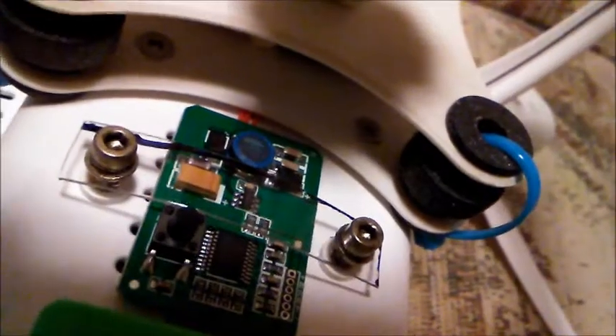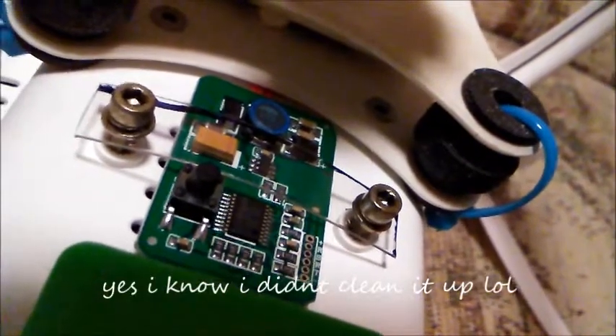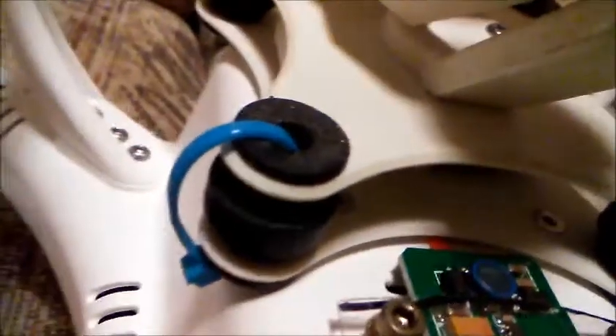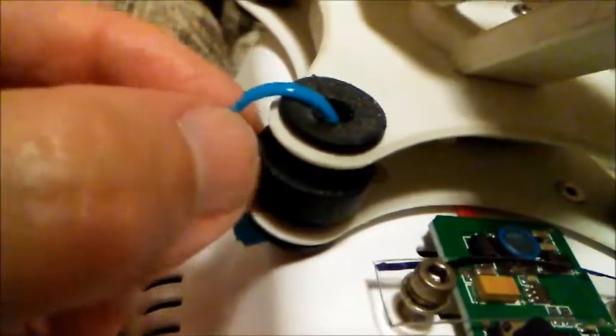You can see it right there. It's got those nuts that are built in — plastic and whatnot. I just took a piece of Lexan and cut a rectangular-shaped piece as a strap to hold that VTX in place so it won't flop around and vibrate. It's only held on by two wires. And also these little zip ties here — they're not on there tight, they're just anchors, if you will, should you crash, so you won't rip your gimbal wires out.